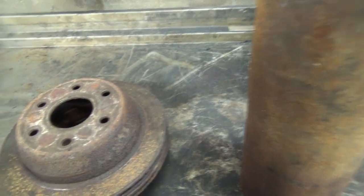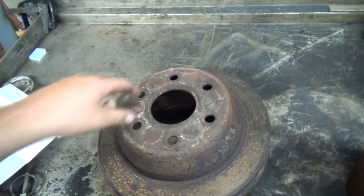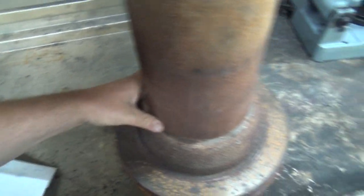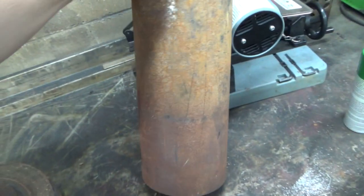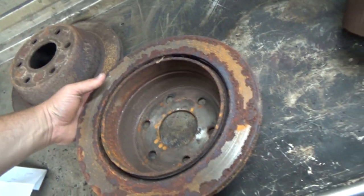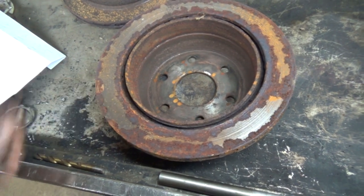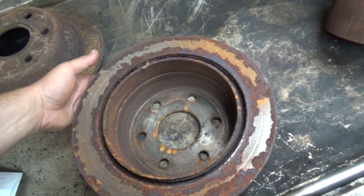And then what they were doing was, this is your primary burn chamber, they call it, and then they used a piece of this stuff for a secondary burn chamber. Basically you'd have to put this up here, kind of like that, and cut the inside out down in there, right? So you'd mark this and then cut that out with the plasma. Awesome. And this thing then gets drilled with a whole bunch of holes too, so it lets some more air in. But now I'm thinking down here is probably going to need holes as well, or possibly even down through here a little bit, a couple of holes around. I'm going to have to look at some of their designs to see how they did theirs, because I know it's going to need quite a bit of air. But you'd still want a pot area down here for the stuff to go in and burn from, right? So I don't know, we'll have to figure that out.